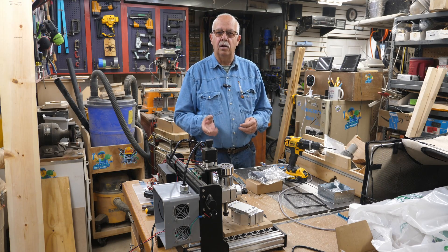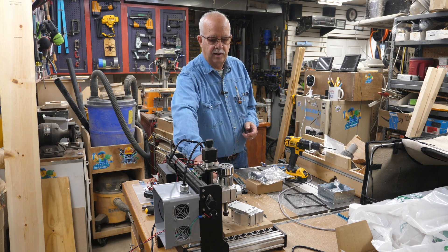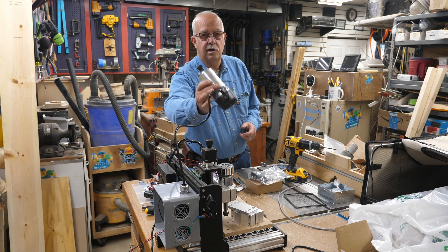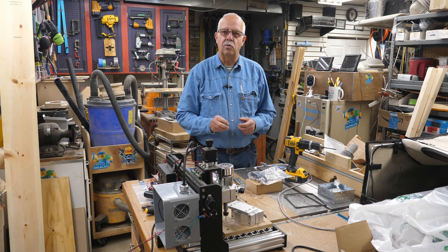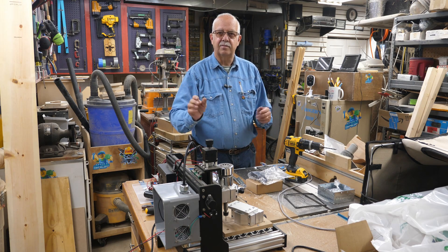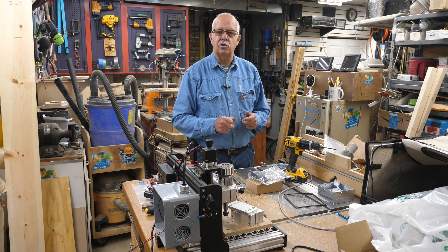So what kind of a mess do I have going on here? I was in the process of upgrading my Analect CNC, my 3020, to a 65 millimeter trim router — not an official spindle, there's a difference — but this has an ER11 collet and will handle quarter inch and eighth inch bits. However, this runs on 120 volts whereas the stock spindle runs on 24 volts DC, so I need to do a little conversion. Being a retired electrician, it's right up my alley, so let me show you what this all involves and how I did it.